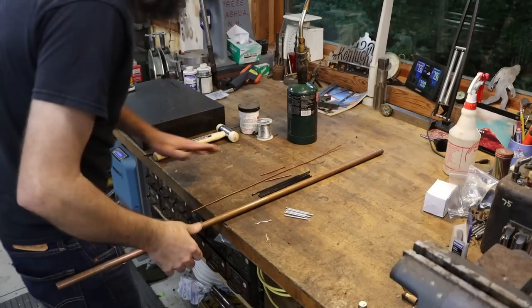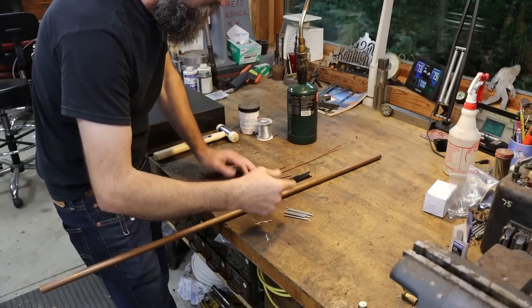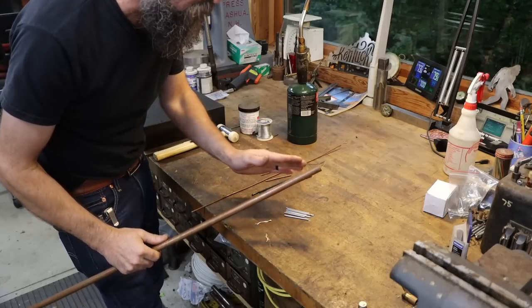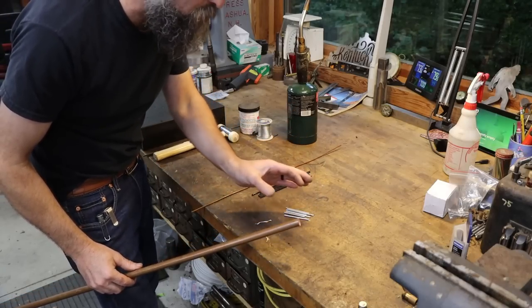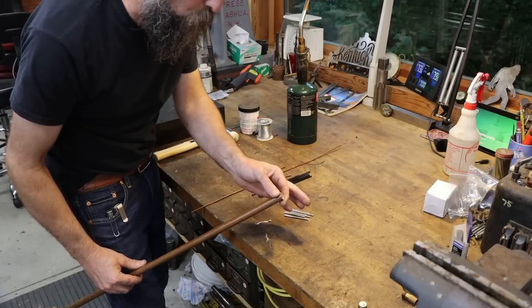So the idea with the spray nozzle is to get that coolant as close as it can be to the area of the wheel that's doing the grinding. And what I want is a spray nozzle that is about 5/8 of an inch wide, a little wider than what my wheel is. And normally I'll run a 1/2 inch wheel, sometimes a 3/4 inch wheel, but most of the time I'm running a 1/2 inch wide wheel.